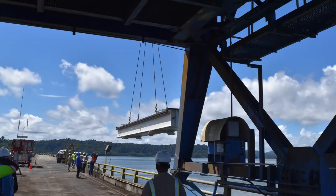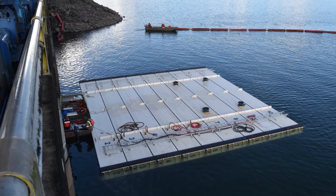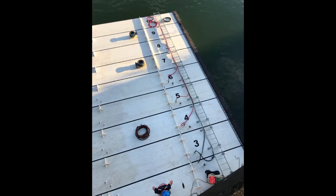Individual caissons are typically transported to the site on a flatbed trailer. They are lifted from the trailer with a crane and placed in the reservoir. Once on the reservoir they are floated and linked together with the link plates. A ladder has been added to this bulkhead, and you can see the air hose lines used to evacuate the water from the caissons once they are ready to float it away from the piers.